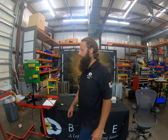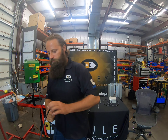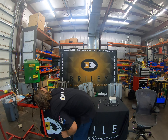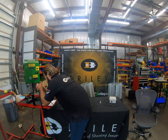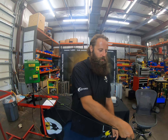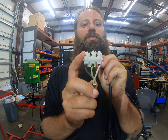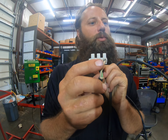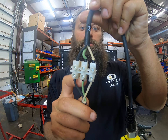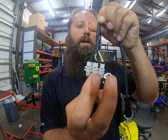Next, you're gonna want to connect your pull cord wire. The pull cord is going to be the number two wire — it comes in your kit. Go ahead and plug it into the number two port. Once you've done that, you will have three wires coming off the bottom: black, green, and white. This is set up here to represent the center pole — you're gonna have to run these wires to wherever you want to plug in your pull cord. You'll see it is connected black to black, green to green, white to white. Green is your common, so when you touch those two wires it trips the high house, and when you trip the other two wires it trips the low house.